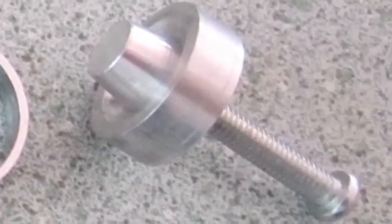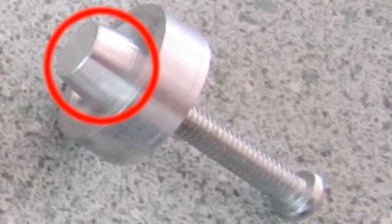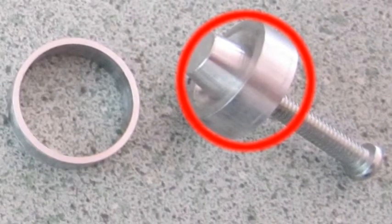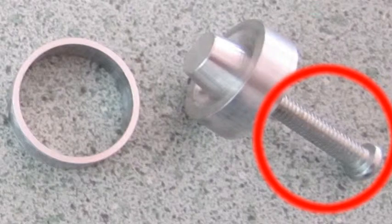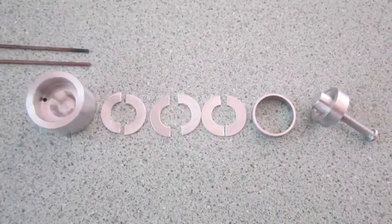The final piece is a top die which forms the shape of the inside of the button cover. It is also highly polished and the taper matches the PCB push button taper. The chamfer is what forms the spear locking lip to hold the cover in place. The OD of the top die fits into the ID of the tube. The M4 screw is used to force the plastic into position in the die assembly using a clamp, pull the top die out and make it easy to handle when everything is hot.